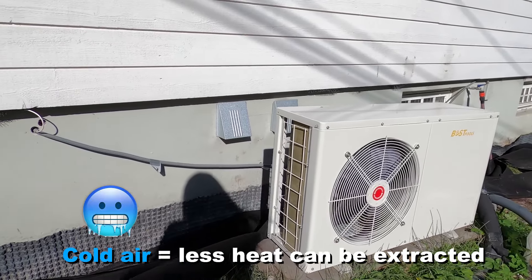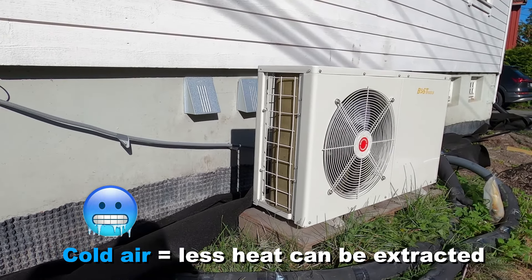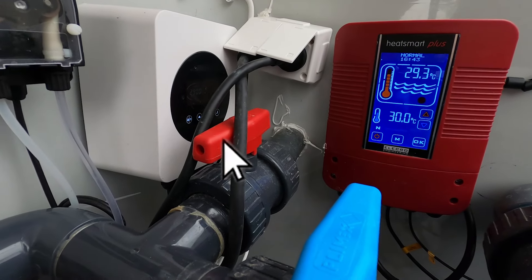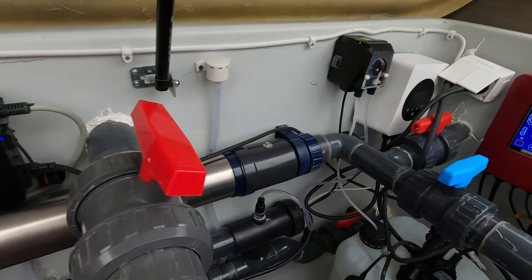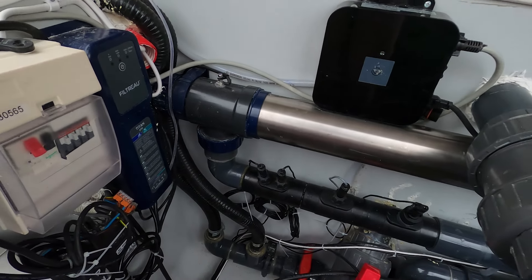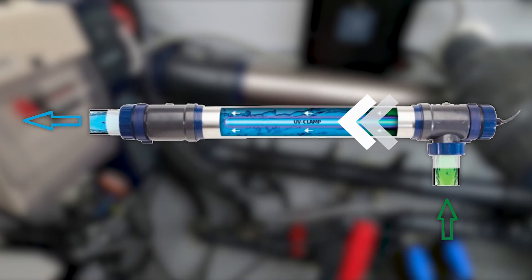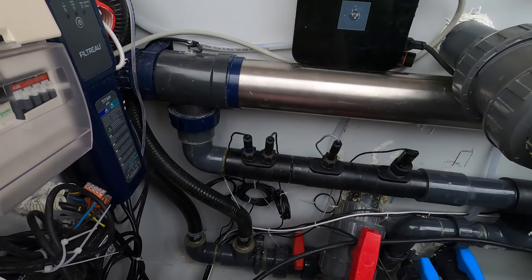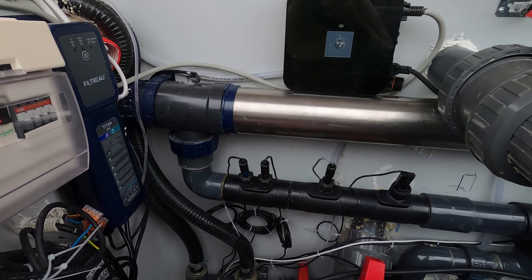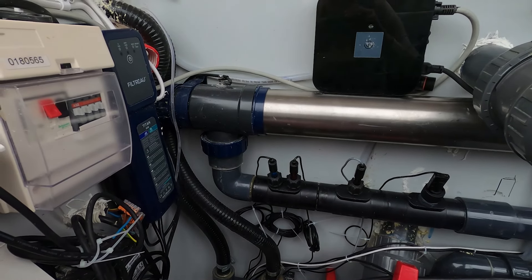However, the colder the surrounding air, the less heat can be extracted and the COP value decreases. When the water has returned from the heat pump, it goes back into the technical room and into a bypass valve with a red handle indicating it's now hot water. From there the water goes into a Filtrio Titanium ADW UVC lamp. UVC rays have the highest energy in the UV spectrum and are often used for treating drinking water — the high level of UVC radiation neutralizes almost all kinds of bacteria, viruses, and even fungi, providing clear and clean water. While probably a bit overkill in combination with our existing system, the UVC complements the hydrolysis, electrolysis, and ionization from the Aqua Xenic and ensures redundancy.